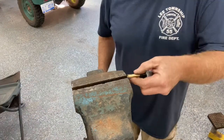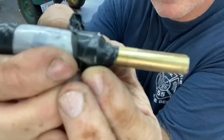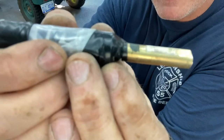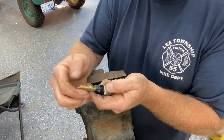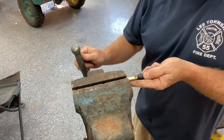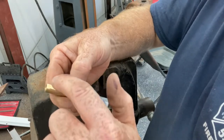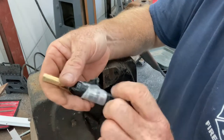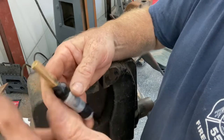Flipping it over, doing the same thing on this side. I extended that flat a little bit further. Now it's the do-or-die moment because I have to hack this extra half inch of material off. On these cartridges there is a little extra shoulder to identify whether the valve is supposed to be one way or the other for hot and cold, so I just took my file and made a little X where I'm going to cut it off.